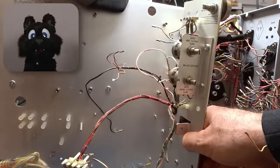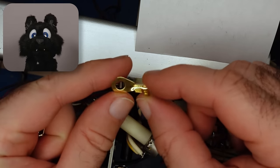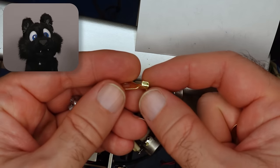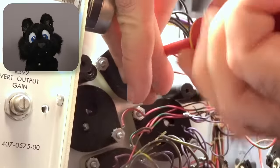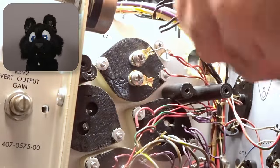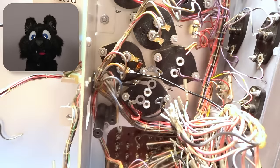The capacitors need eyelets on the wires. Normally, I'd use solder style ones, but I only had this set of crimp-ons on hand. To make them work, I trimmed them back slightly, used the crimp part to hold the wires in place, and then soldered them. Crimping only works reliably when there's one or, in a pinch, maybe two wires per connector. Here we need to add 6 or 7 of them at times.